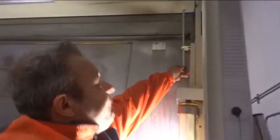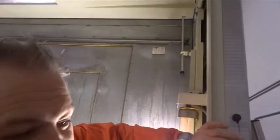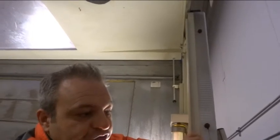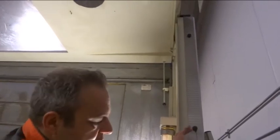Let's go in here, Jörg. You see this little knob here, this black one up here. Let me go up there. So if you pull this down, the machine will be locked during shipping, the door will be locked. And when you pull this down, you cannot go inside when it's locked, right? So you go on top. Either way, you disconnect the switch: take two screws out and disconnect the switch, what I did, or you can see this mechanical thing, like a V-notch from the top, you can push down, then you can open it, or you just take the switch tongue off, and then you can open it and level your machine and set everything up. Okay guys?